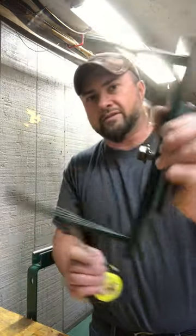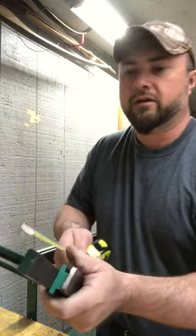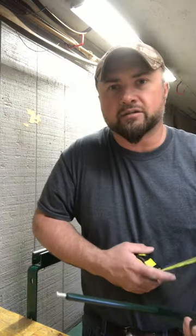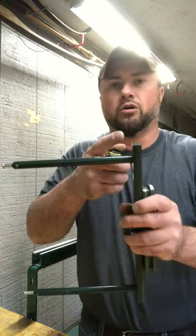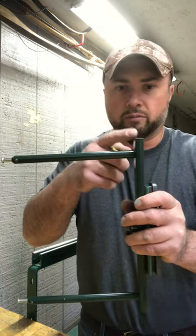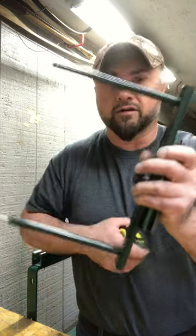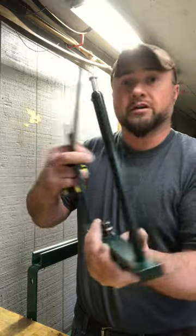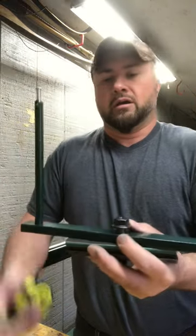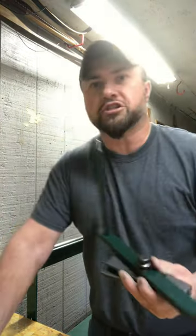That rail makes what you'd call a T — or whatever that is — 12 inches long. If you split it in the middle, that's six inches. You want to make the hole that your rod goes in even from this end to here, the same as the other end, so they come out right when you spin it around. Pretty simple, good idea, very strong and cheap.